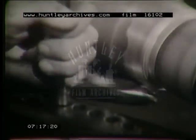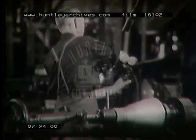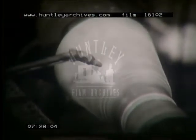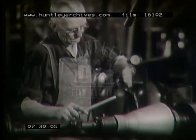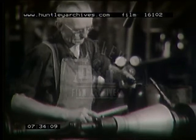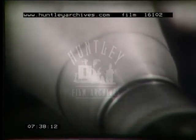6. Learn the feel of your work. Feel the metal flow under the tool. If the metal becomes too hard to flow properly, its workability can be improved by heating it with a torch while the shell is rotating. Of course, the metal may not be fully annealed by this method. The annealing temperature has been reached when a soft pine stick rubbed on the metal leaves a brown char mark.